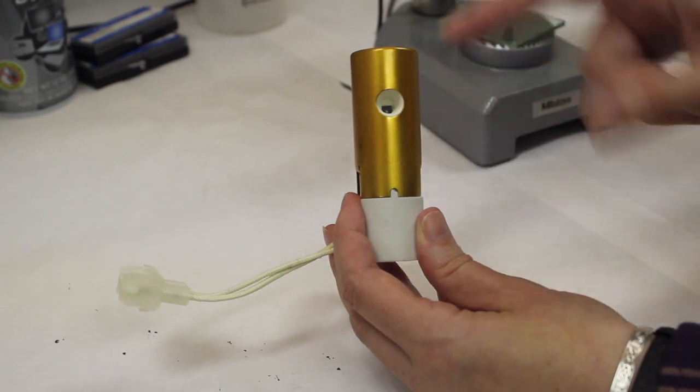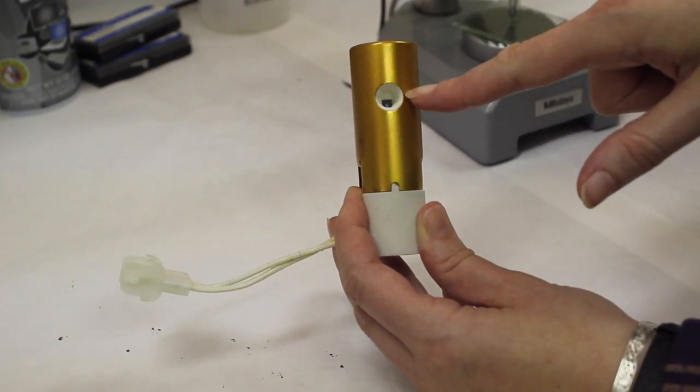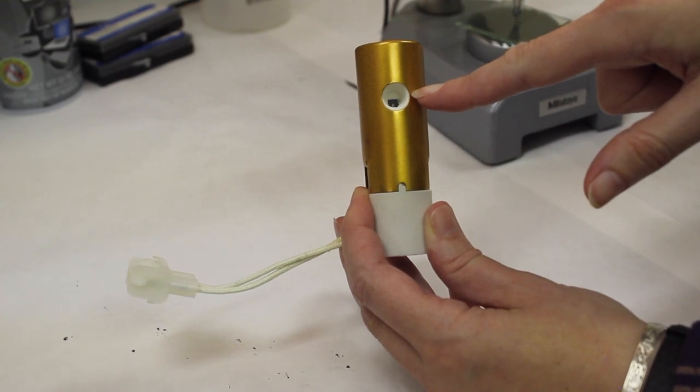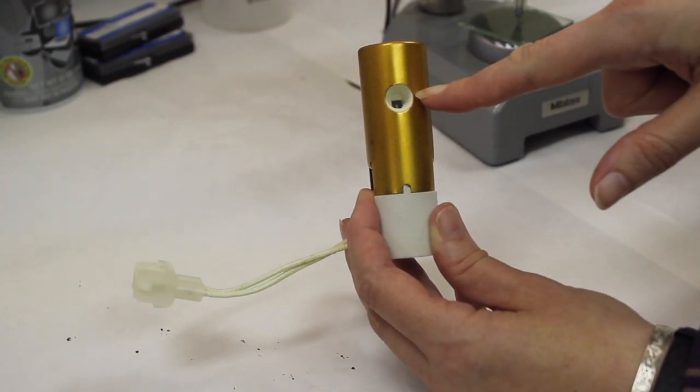So that's the light source, and it's insulated. If you look into that little hole, that metal thing is the silicon carbide — that's the actual light source, that's what glows. It heats up and glows, and that's the infrared light source.